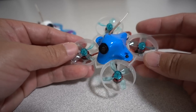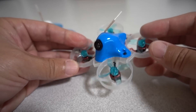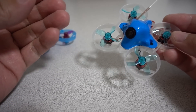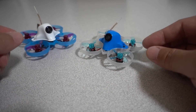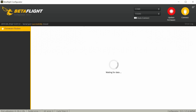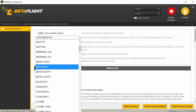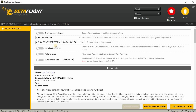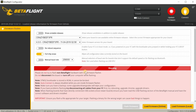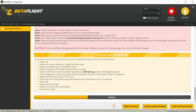I'm going to show you how I put Betaflight 4.0 on here — basically just flashed it using the Crazy F3 target as a basic flash. I'm not going to go over the details of how to flash it; you can watch the other videos for that. I'll show it on screen, and then I'm going to take the community presets from the Betaflight wiki page for the brushed and brushless whoop classes. This should be applicable to 65mm or 75mm types with 31mm or 40mm props. I'm just pasting those presets into the CLI and using the filter settings from the presets.